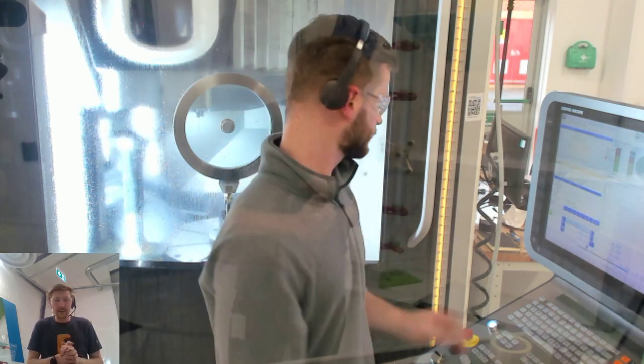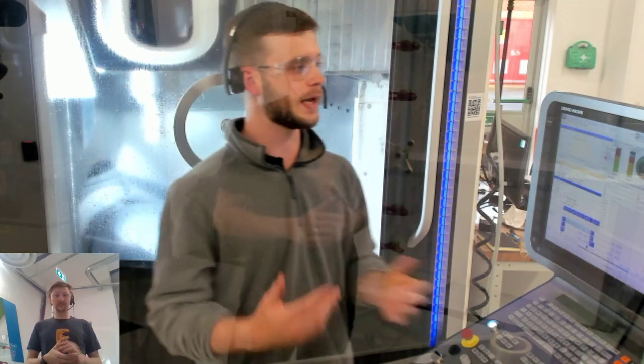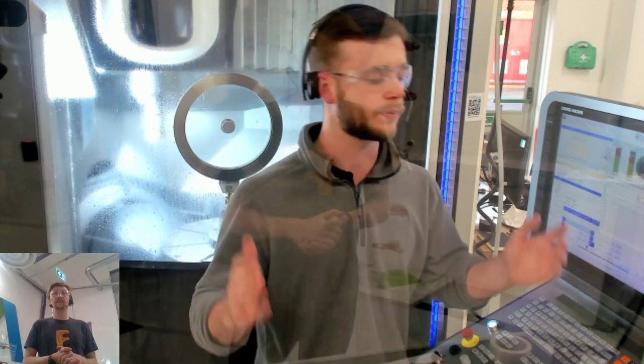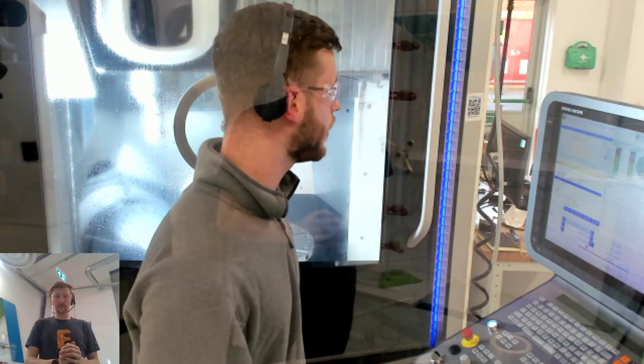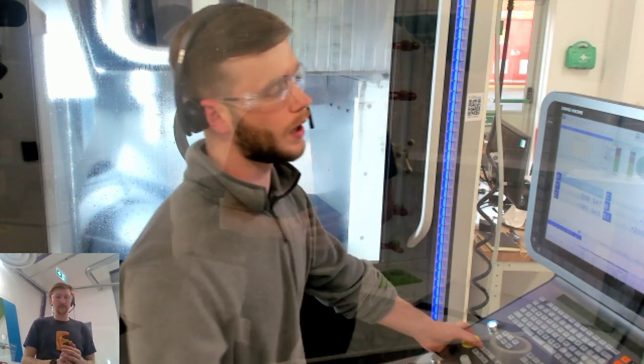Yeah, absolutely. So what we're going to show you now, we're going to walk through setting the part up, so datuming the part, setting the G54, setting the work plane, whatever you want to call it. And we're also going to look at orientating the part or the work holding in which you're holding the part in. So we'll start off with orientating the part or the work holding.